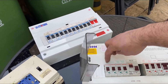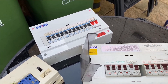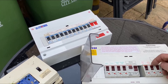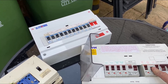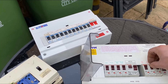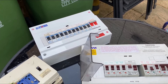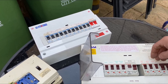A lot of stuff that's on RCD will always be in green colouring. So if you have a fault on this circuit and it's on the main switch side, it'll be one of these — all you've got to do is flick it back on again. If it keeps coming down and it's something on your lights, it could be one of your light fittings. Go around, turn all your light switches off, try this switch again. If it goes on and stays on, then you know it's one of the lights — go around and put the light switches back on just one at a time until it trips off again. Then you know that's the one causing the fault and you can get your local electrician to come and sort that out.